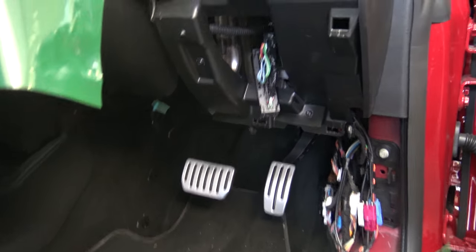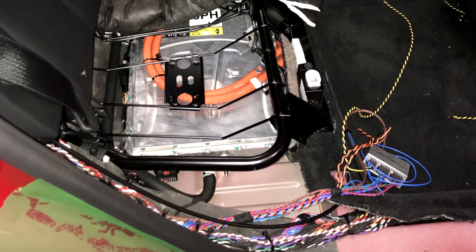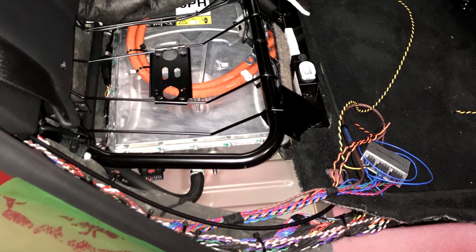The factory amp is up here on the right — you can't see it, but it's up there. What had to be done was cables from the output of that amp to go to the input of my amp going in the boot, and obviously cables going back from my amp back into where that original spot feeds the speakers. So a couple of cables there, and there's the high-to-low level converter — and of course a missing back seat.